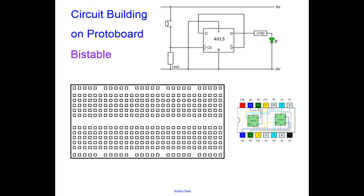My next circuit is a bistable circuit using a 4013 chip, which has 14 pins — 7 down each side. Every single diagram I've done, I start by drawing the chip in the center of the board. Add the positive power supply and the red wire going to positive — in this case labeled as 9V — then the black 0V wire. Pin 7 is 0V. That's my chip wired up with its power supplies.